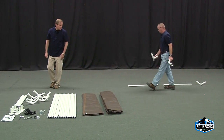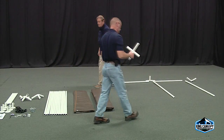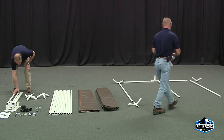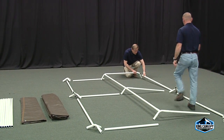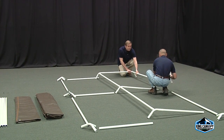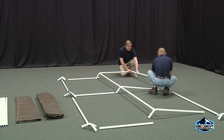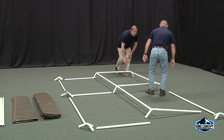When all the parts have been accounted for, begin to lay out the frame according to the instructions. Each three-way fitting should be placed at all four corners and two end peaks. Now that all the pipe and fittings are laid out as displayed in the instructional diagram, begin to connect the center pipe and fittings. Start assembly by working from one end to the other, connecting the center ridge pipe into the three-way fittings and four-way fittings.